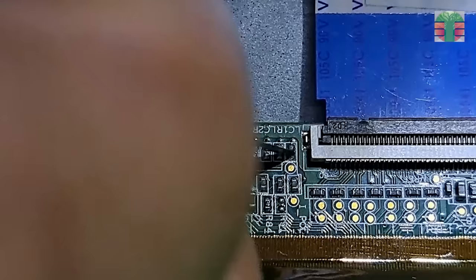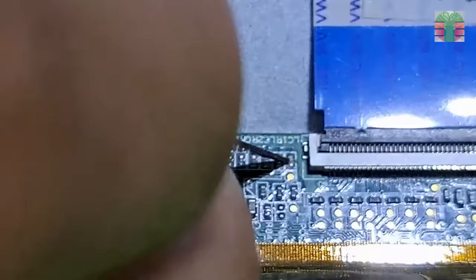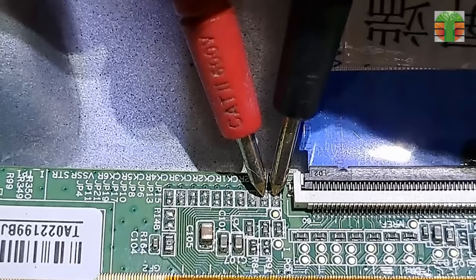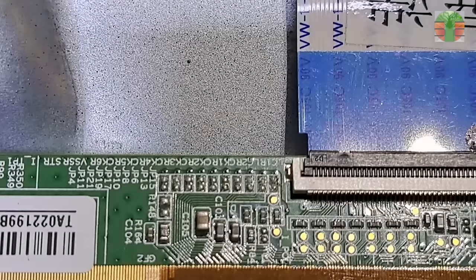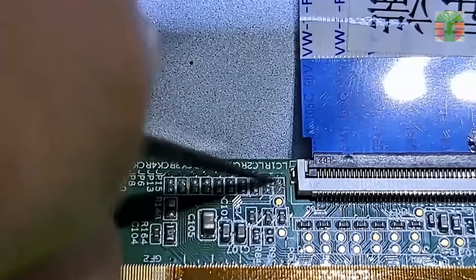This layout of the circuit is good because when you cut the wrong line, you can easily reconnect them. Let's cut the LC1 first. The resistance between LC1 and LC2 is now about 10 megaohms. The right side of the panel has the partially shorted LC1, LC2, and CKV1 lines. Now let's cut the LC2 and the CKV1.